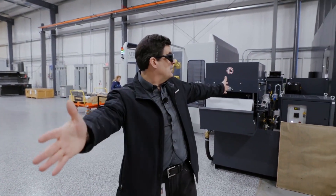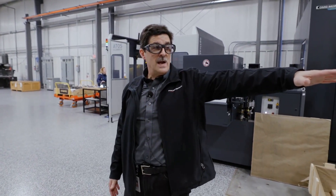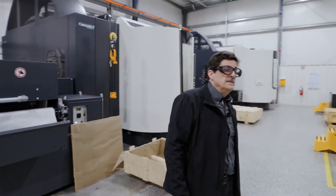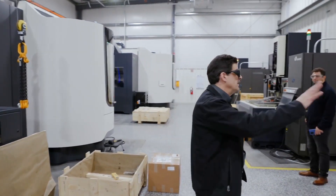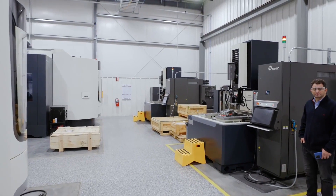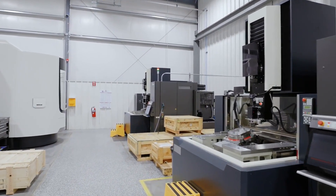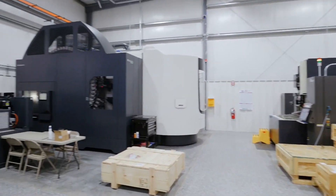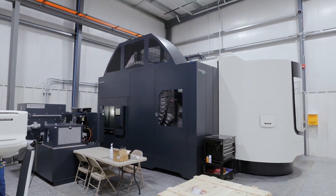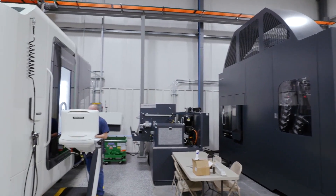This area of the shop is rotor machining. We have two large multi-axis wire EDMs and two Mori machines. These are what are called mill-turns — they can both mill and turn, which allows you to make rotor parts: turbine wheels, compressor wheels, and the two-to-four spool, which is a multi-slot spool within the low pressure compressor. All of those can be made using the two wire EDMs and the two Moris.